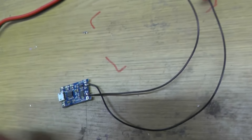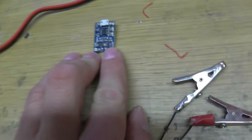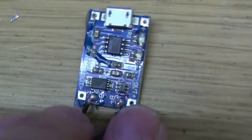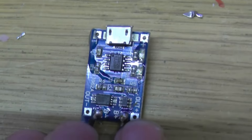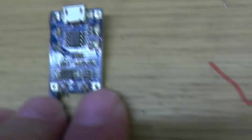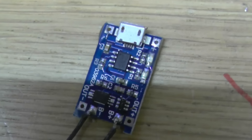With the quantity I have, I can still make something of this. What I've been using to charge them — because when you've got that quantity you're going to want some sort of setup to cycle them — is these little TP4056 modules. Let me look, I've written it down: TP4056. And they come in micro and mini USB input varieties.